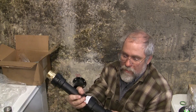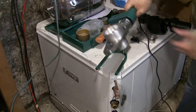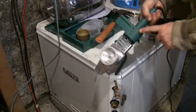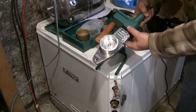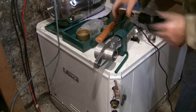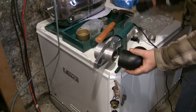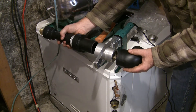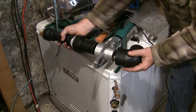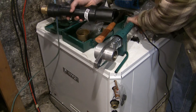I'm going to start by putting the elbow that you see right here onto the end of one of these, and we are going to do our best to make that happen. First things first, we're going to go ahead and plug in the machine — you should see the green light come on — and we're going to let it heat soak. That's going to take about 10 minutes to get up to proper temperature and everything to get all nice and heat soaked before we try this. Then this one is going to go on this side, and this is going to go on this side. According to the manual, we are going to hold for 20 seconds, and then we're going to push them together.